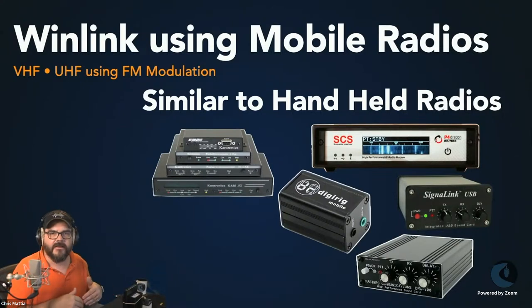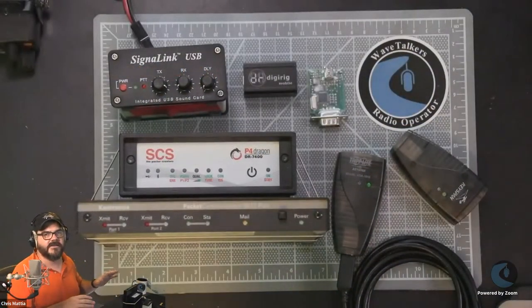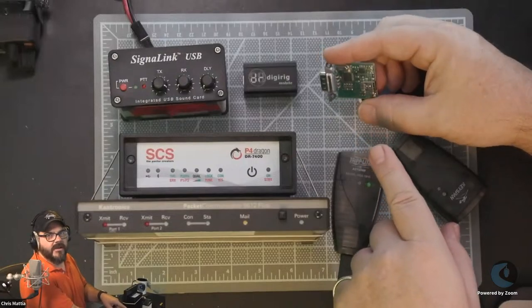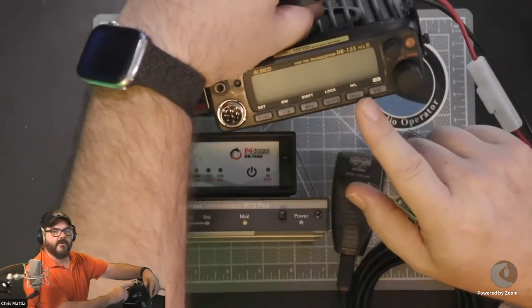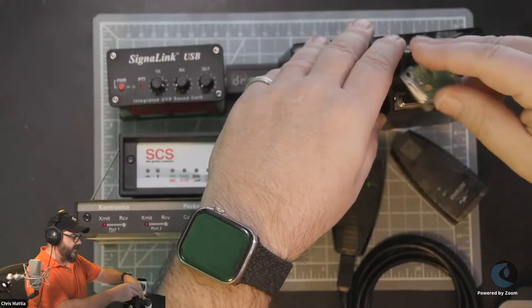If you are a SHARES operator, you're likely going to have a Pactor modem. As an amateur, you may or may not get into the Pactor realm. Another interface not talked about last week is the RA boards found on Repeater Builder — these have a DB9 connector and plug specifically into Alinco mobile radios with a little USB adapter. They're a very small sound card. Here's that RA board — you can see it's really small. One thing I don't like is there's not enough space between the circuit board edge and the screw holes to put a locking screw in.